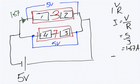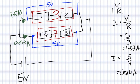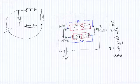Likewise, for this one, we can say the current is 5 over 7. What's that, please? Actually, I have it here. 0.714 amps. So the current down here is 0.714 amps. Now, these are in parallel, so what happens to the current here? They add together. So if I add my answers together, I'll get 2.38 amps. So what I need to do is go back to my picture here.